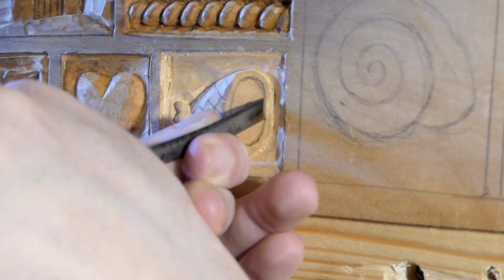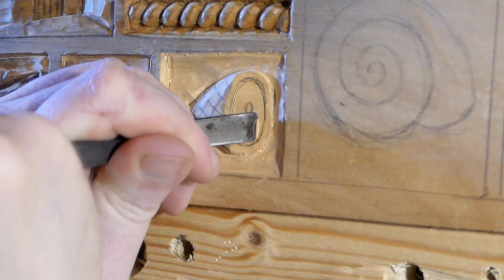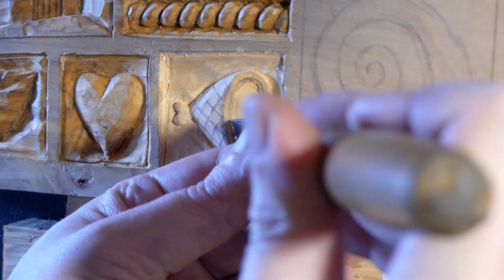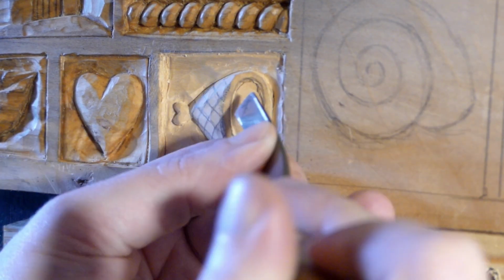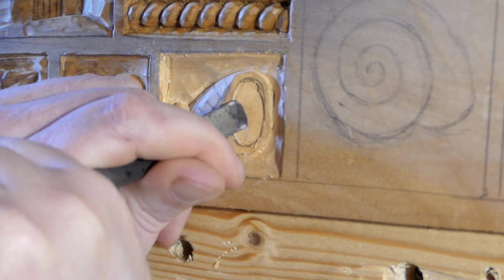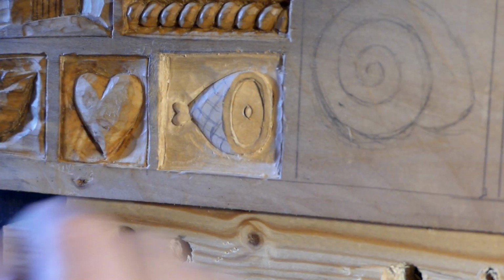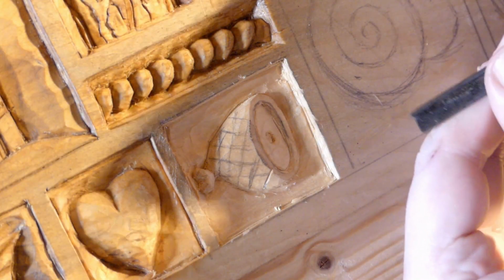The good thing about using the corner of a small chisel is that you can twist and turn it to form curves, which is especially handy if you don't own every single wood gouge that has ever existed. I also try to use chisels in every way that I can. Just because a chisel is designed for a specific purpose doesn't mean it can't be good at performing another task, much like the bench chisel we used earlier. This also helps with flow, which may not seem important at first glance, but it can really speed up your carving and make it so you can improvise with fewer tools.